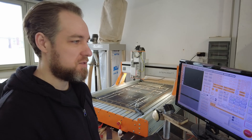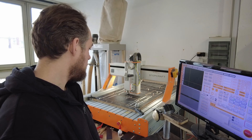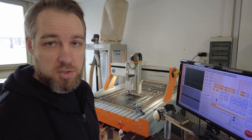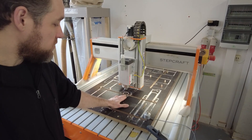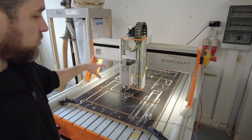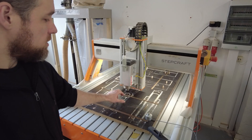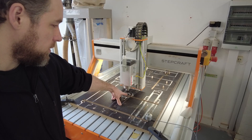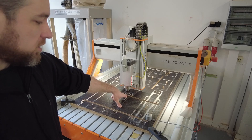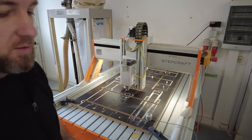I always have to set a zero point where I actually want it to be zero, and I have it here on my table. This is my waste board and it has all the locations of several parts — I'm making my decks, my bridges, my fretboards, basically everything on it. This hole is quite in the center and I want to use it as my zero point. I've already zeroed it yesterday but it looks a little bit out of center, so I have to center it again.